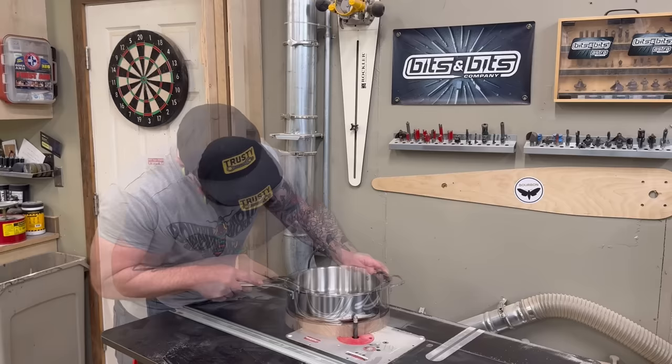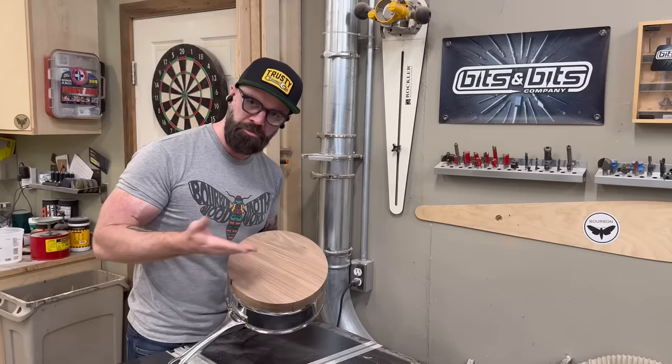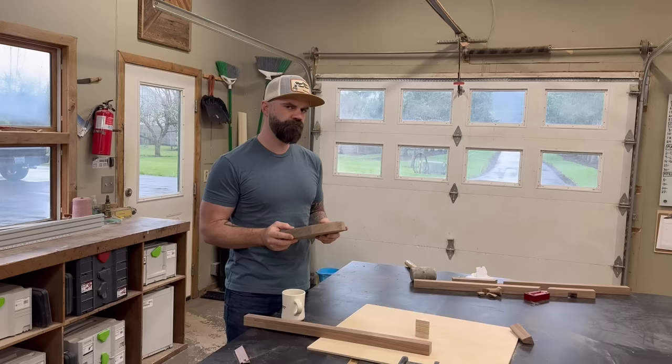I went to the band saw and cut out that shape, leaving a little bit of material outside the line. I added some double-sided tape to the bottom of my blank and stuck it to the bottom of the frying pan. With the blank firmly attached and overhanging a bit on all sides, I went to my router table with a half-inch shank compression flush trim bit and started cutting out a perfect circle. The frying pan works amazingly — it's really deep so you have plenty of room to work, and it's got two nice handles so it's easy to hold. In no time I had a perfect 10-inch circle. My stool seat was complete — kind of.